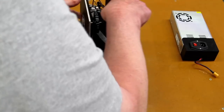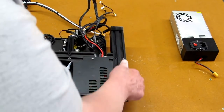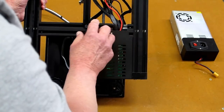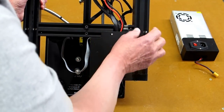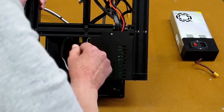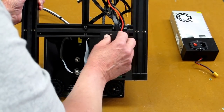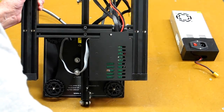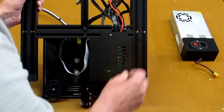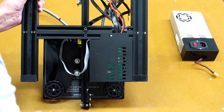When you turn this over gently, all of these wires are coming out where this piece of extrusion has been milled away. They have not deburred this edge at all. So one of the first things I intend to print is a plastic piece that snaps in there to protect these wires from abrasion or being cut. Some of these already have a little rough edge on them — probably would never be a problem, but the engineer in me says that needs a piece of plastic put in there.